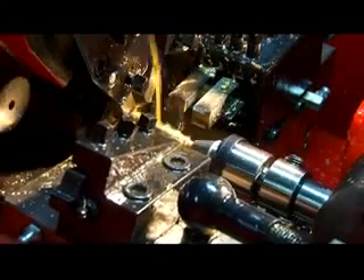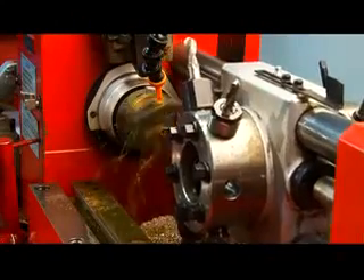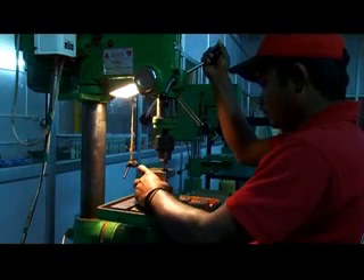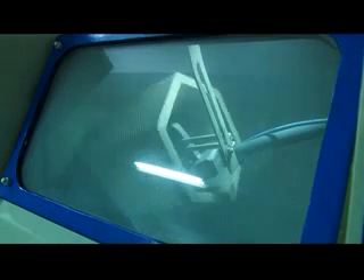The excess brass that flows out of the die during forging is removed with the help of another die mounted on a 30-ton capacity press. Six different operations are then performed simultaneously on a CNC (Computerized Numeric Control) machine. A nozzle and pressure gauge bore are drilled on an automat, followed by bores for the handle, trigger, and a special bypass bore for the pressure gauge. On completion of drilling, the valve body is exposed to a three-minute blast of aluminum oxide granules, creating a rough texture that allows it to obtain a matte finish nickel chrome coating.